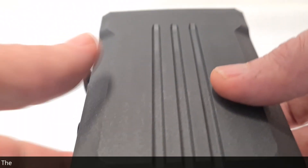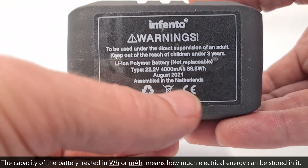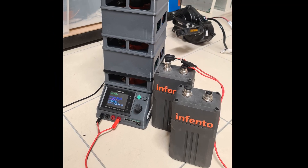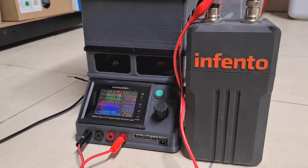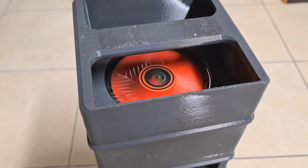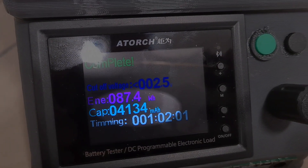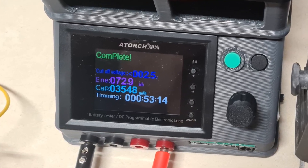The capacity of the battery, expressed in watt-hours or mAh, means how much electrical energy can be stored in it. The sticker on the ePulse battery indicates 4000 mAh. I double-checked this by connecting two of my ePulse batteries to an electric load device, which converts stored energy to heat and counts it until the battery shuts off. The result positively confirmed Infanto's claim — I measured 4130 mAh on a brand new battery and 3550 mAh on a battery with four years of age.